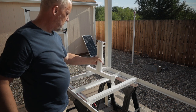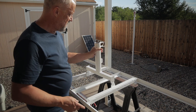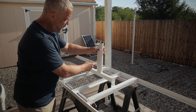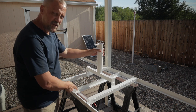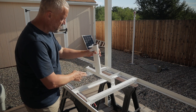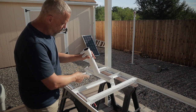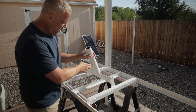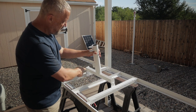This mounts on here with two bolts and it'll be able to tilt. I've also built a mount that will connect this center piece of frame with an angle piece that'll bolt on. After I find the optimal angles, I'll cut a piece the proper length and drill the proper holes so I can put a solid mount from the pole to the bracket that holds the solar panels — that way I don't have to rely solely on the tightness of the bolts.